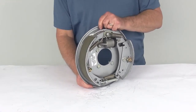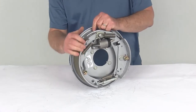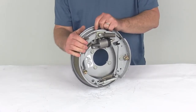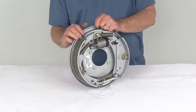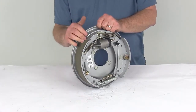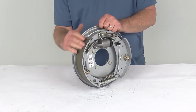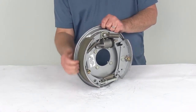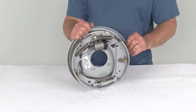These brake shoes are lined with an automotive grade friction material. This friction material is fully bonded — it's not riveted to the shoes — which gives longer life and more braking torque. The pad has a nice tapered edge on each end rather than a sharp cut edge. They also do a circular grinding on the pad to prevent cracking and crumbling that can lead to mechanical lock-up.